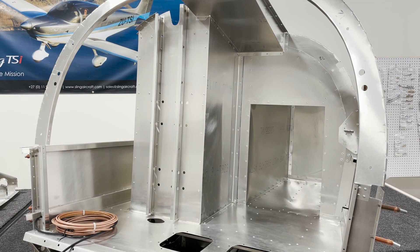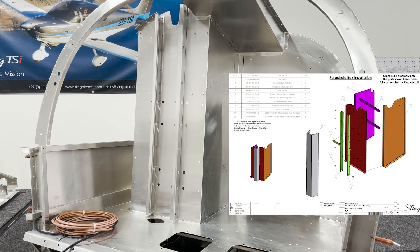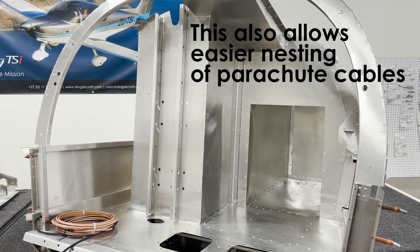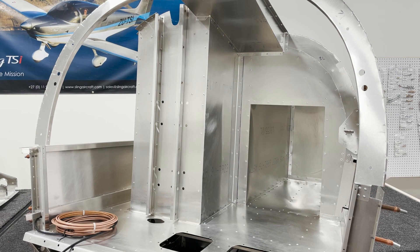The last step for now is installing the parachute box. The process is fairly straightforward — the instructions explain it well, and it lines up with all the holes so everything fits together nicely. You'll notice the top skins are off the rear fuselage for now; I hold off on these until canopy installation so we can wrap them over the top of the canopy without having to wedge the canopy in underneath. The rear fuselage will sit as is until it's ready to be joined to the center fuselage.